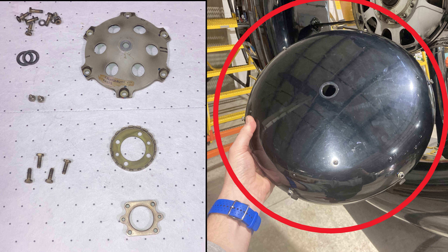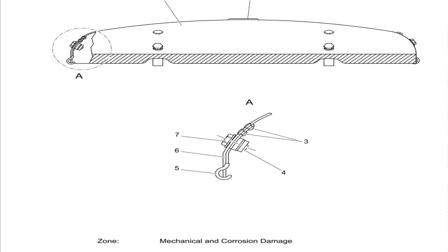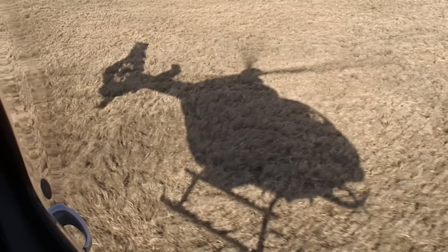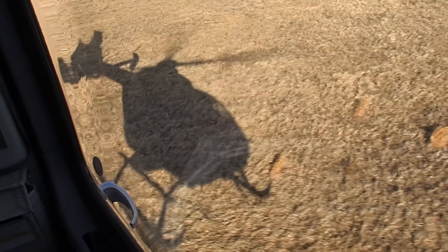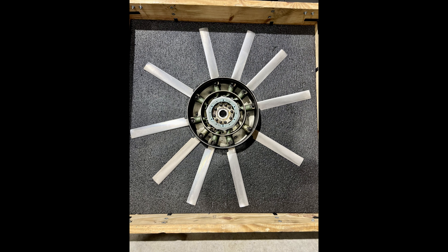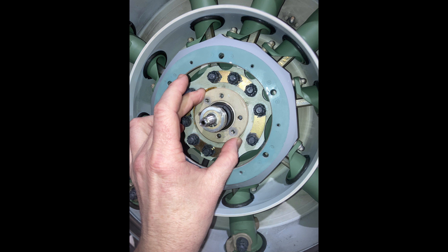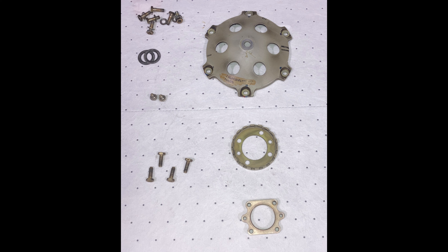The main thing is that these five items you need to complete the inspection on and sign off in the logbook, because they're not included when you receive an inspected tail rotor: thrust nut, locking washer, thrust screw, center flange, and tail rotor fairing. We're going to go over the whole process — a quick removal of the tail rotor and installation of the new tail rotor — and some things that you might get jammed up on. The main point is that when you do a tail rotor assembly replacement, you also need to sign off these other items that weren't replaced, confirming you complied with the 2,000-hour four-year inspection.